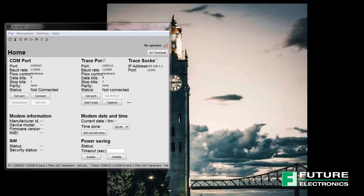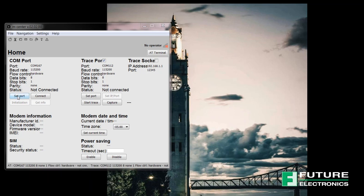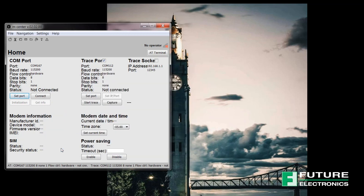You can use Tera Term to communicate with the SARA-R5 module, but the best way is through u-blox's own cellular evaluation software for Windows called mCenter. It is free of charge and really easy to use. First, set up your port by selecting the first one. Make sure you have the appropriate settings: 115200 for the baud rate, 8 bits for data, 1 bit for stop, and none for parity. Then select OK.